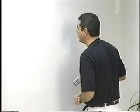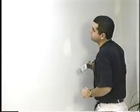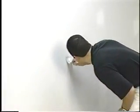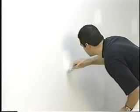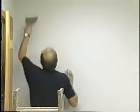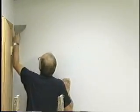Show-through may occur if the wall underneath has any areas with significant contrast. All ballpoint pen ink, wax crayon, marker, oil-based stains, or any foreign matter that may bleed through Walltalkers needs to be cleaned or coated with a stain-blocking primer. Use a multi-purpose remover in order to remove these markings. For foreign matter, such as tape or stickers, use your scraper to work these off and remove any adhesive left behind with the same cleaner.